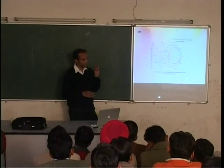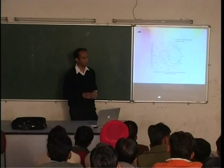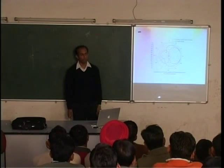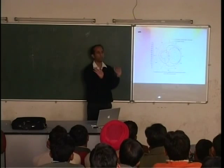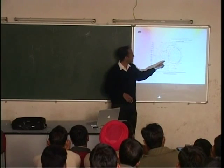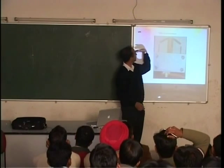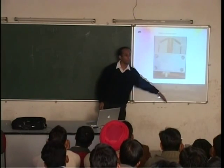But some of them concentrate the power in a sharp, small angular region. Those are called a pencil beam. Okay? Like pencil, small angular. This particular antenna was designed to have the power distributed almost equally throughout a very large angle, but not 360 degrees. Idea was from plus 90 to minus 90 in terms of the figure. This direction, I should have equal power almost everywhere. And suddenly no power in the back side.